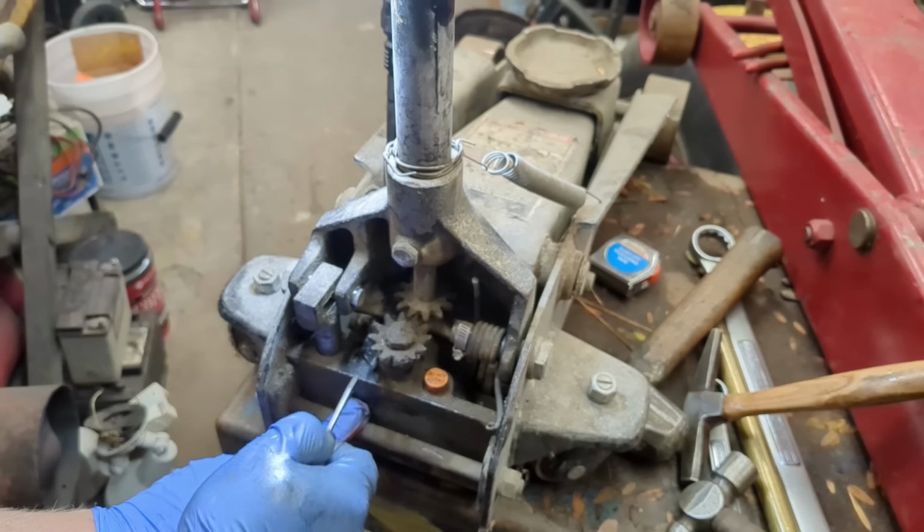This right here is going to be our check balls. If I pull it out, I should get one. Should be 2 in there. Oh, maybe there's only 1. See, I don't know if somebody's been in here before. Maybe there's only 1. Let me look at the diagram. I thought there was 2. There's only 1. I was wrong. There's only 1 in there. Sometimes they put 2 just for added weight. There's only 1 supposed to be in there. So it's a good idea sometimes to have the diagram.